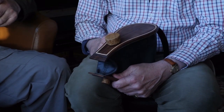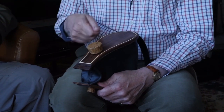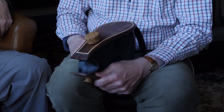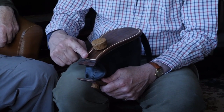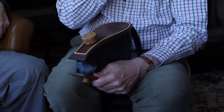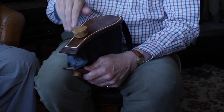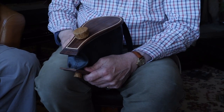I've got one of those. It's got a triangular thing in it. The handheld. Yeah, it sort of reciprocates. It's good for cutting vertical holes in things, slots and things as well. But you just do that by hand and go around and tidy it up. Just get it down to the level, then finish it off with coarse, medium, fine sandpaper, just by hand with a block. And then put it on the polishing mop.